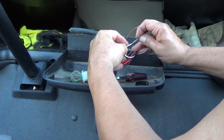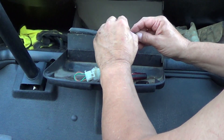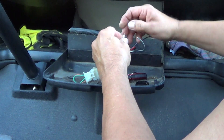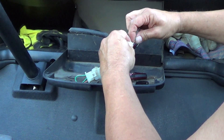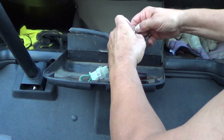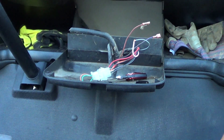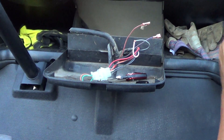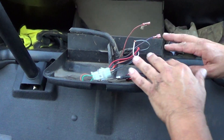When I'm done, I will solder these together. I'm going to make a good physical connection by putting a hook in each one of these, like so. Hook those together. Pinch them shut so that I have a good physical connection between the gray wire and the white wire. Then solder that so that it is a zero resistance, or as close as we can get, electrical connection. I'm going to put heat shrink tubing over this to protect it as well.